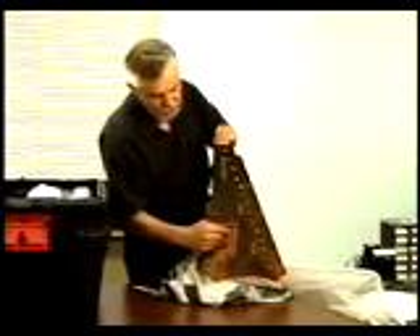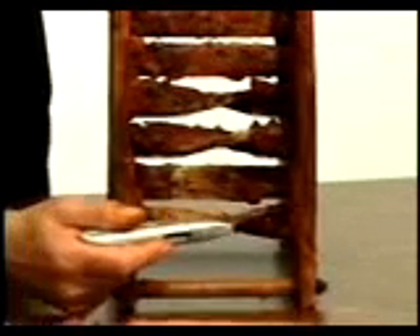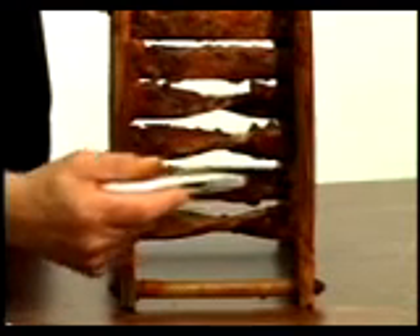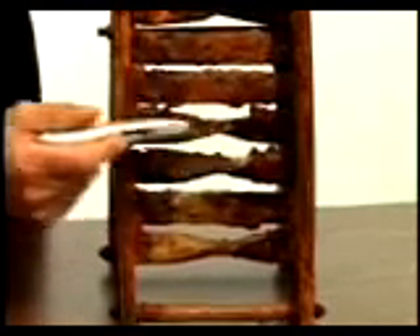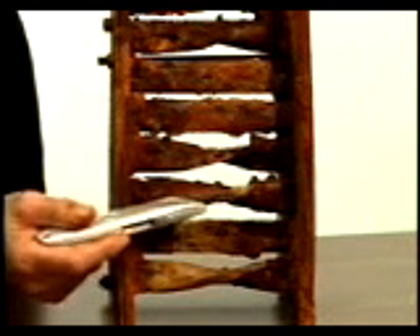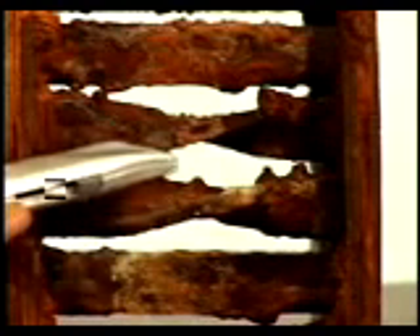The steel coupons include controlled, twisted, twisted and tempered, hammered, hammered and burnt — the whole range. The top one is twisted and tempered, the next is hammered, then twisted and tempered, and twisted. The difference between these two is that one was heat treated. And yet when you look at the rusticle growths between these two, there's very little difference — the rusticles grew as happily on the heat-treated one as on the other.